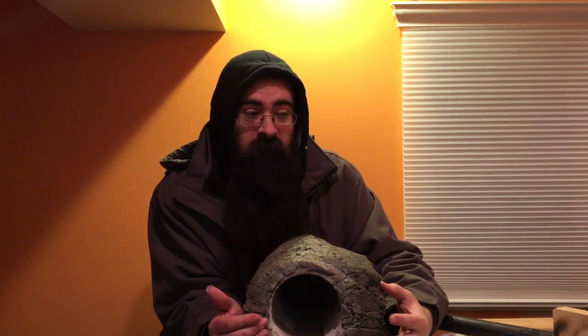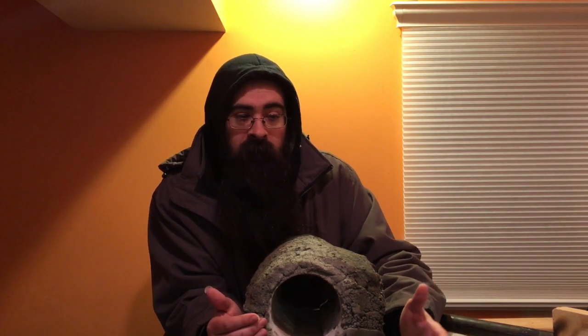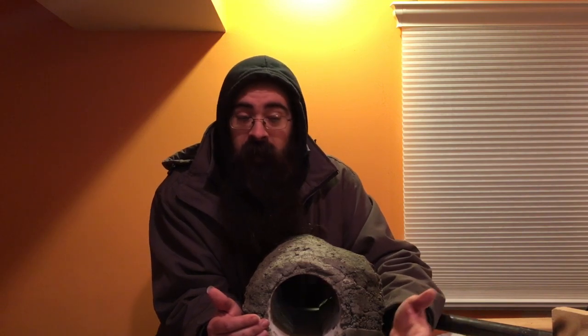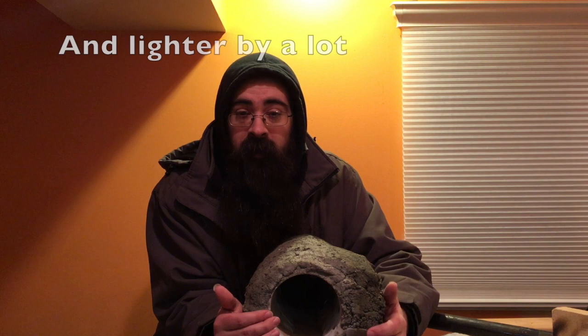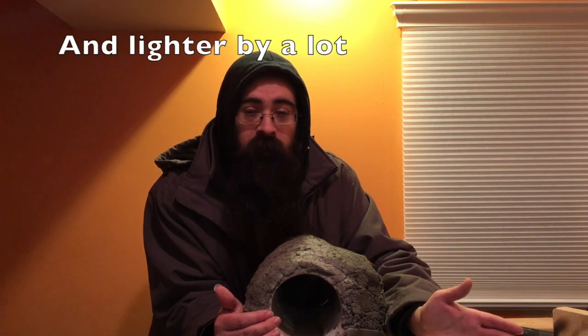A lot of people like to sell their cement saying it's the best. So you have to watch a video 3 or 4 or 5 times. If you ever ask one of those people that made a video about their cement if it's held up, they probably don't respond, or they don't do a follow-up video. Any follow-up videos they do, they'll say they're upgrading to the kaowool. But if they would have used the kaowool in the first place, they wouldn't have to upgrade. The kaowool is just as available as their high-temp cements that they bought, and probably cheaper.